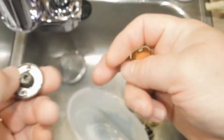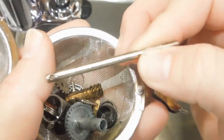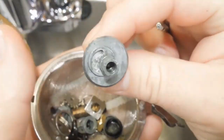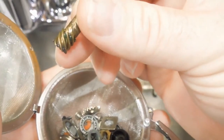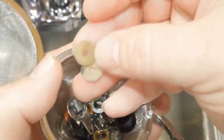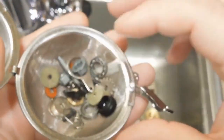The little reel I'm cleaning up is a small inexpensive Shakespeare, but it's actually made pretty well. I've already replaced the spring that did the bail open-and-close function — it was broken, which is probably why someone got rid of it. The line roller has a groove cut into it and it's made of brass, which is too soft, so I'm going to machine a replacement out of stainless steel rod and put that in its place.